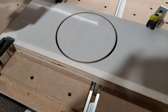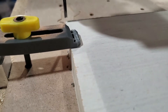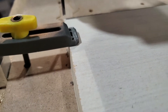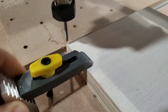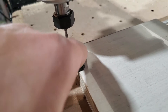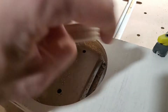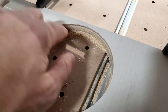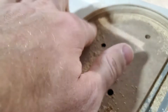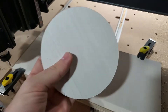As you can see, that was 90% a successful carve. I need to work on my home position location because I just ate up the top of my clamp. Instead of coming across, I need to set the position to come around. But look at that — perfect hole. I don't think we went into the wasteboard hardly at all. I've got to figure out something to do with this now.